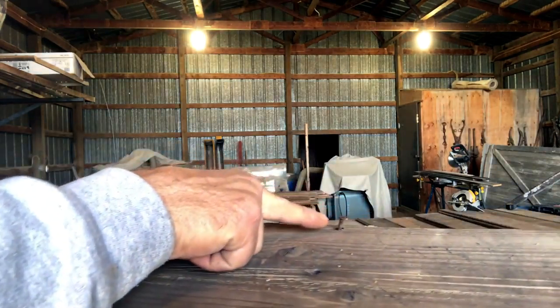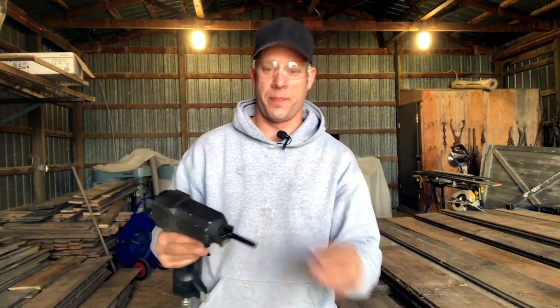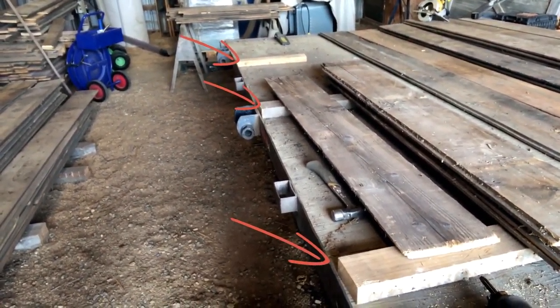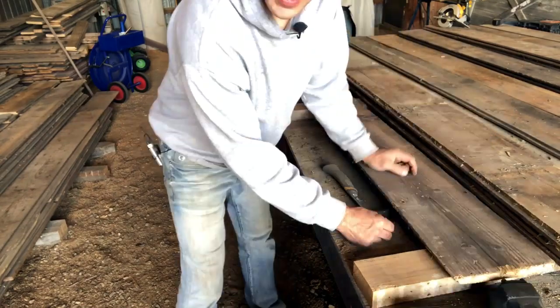Let me tell you a lessons-learned story. It involves the pressure — we've got to turn it down to about 45 now, that's about right. I don't want to shoot the nails right out of the board; I want to keep hold of them and keep them here, not in my tire. The very first time I used one of these, I ordered it, it came in, I was excited, plugged it in at about 110 psi — and right into my shoe, right in between my toes. That's why we have two-by-fours where the wood is lifted up, so when the nail fires through, it hits there and never ends up in my shoe again. Be careful — it's not a toy.